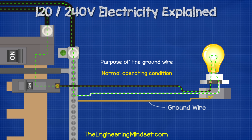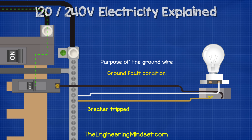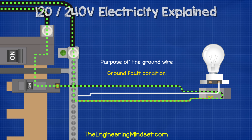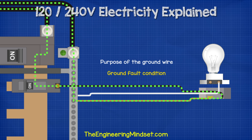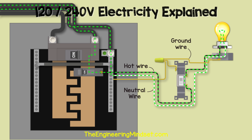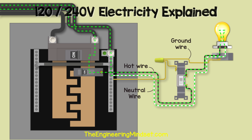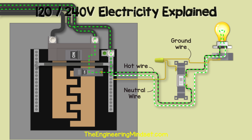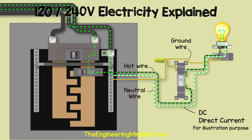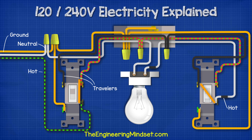The ground wire runs from the metal casing of the ceiling box and switch, also joined to the neutral bus bar. The hot wire carries electrical current to the light fitting; the neutral carries used current back to the main panel and then back to the transformer. The ground wire provides protection for fault current — if the hot wire came loose and touched the metal casing, the ground wire provides a low resistance path back to the panel, increasing the current and tripping the breaker automatically. We've covered lighting circuits in detail in a separate video — links in the description below.